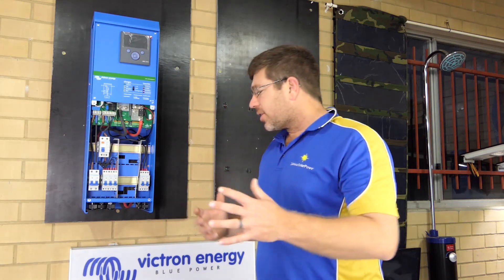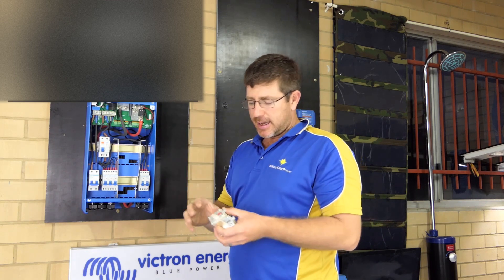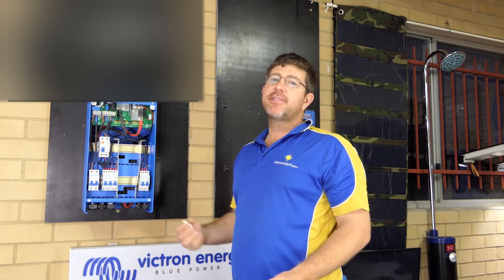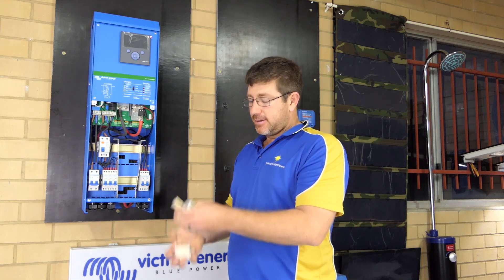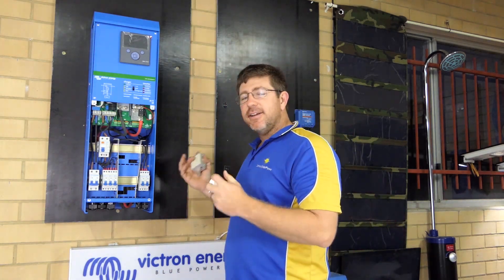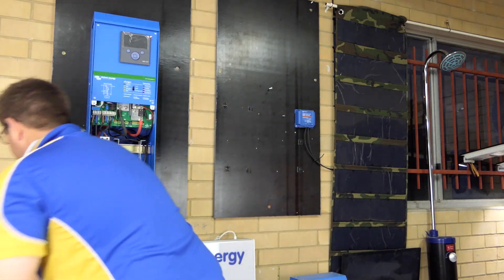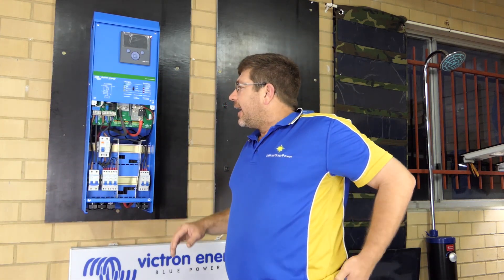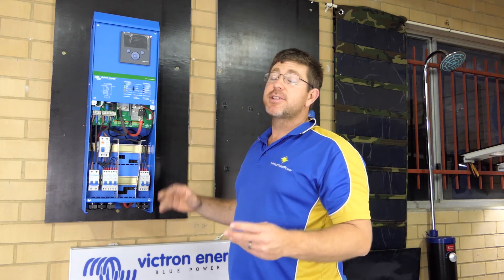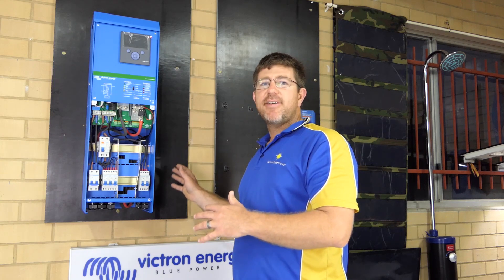There are certain size differences between 24-volt and 48-volt systems. Most systems with a 3 kVA inverter charger, we normally like to stick to 24-volt. When you're increasing size and going over to a 5 kVA inverter, you can do it on 24-volt, but you'll require a much bigger fuse — financially these cost almost three times as much — and the fuse holder is a lot bigger too.